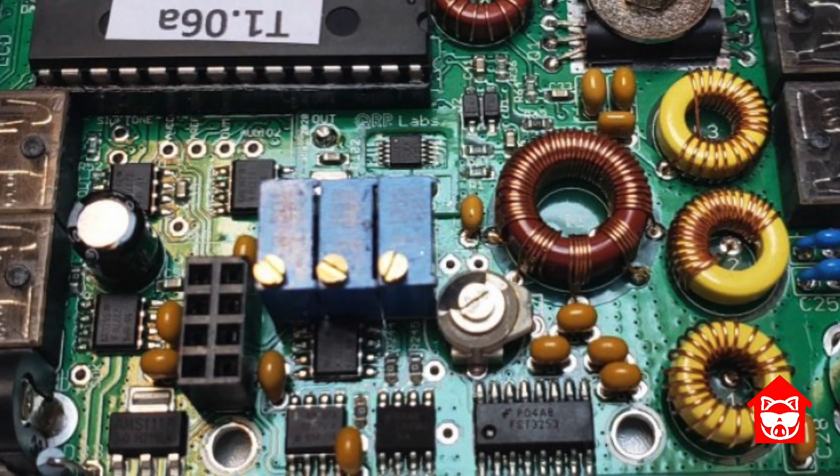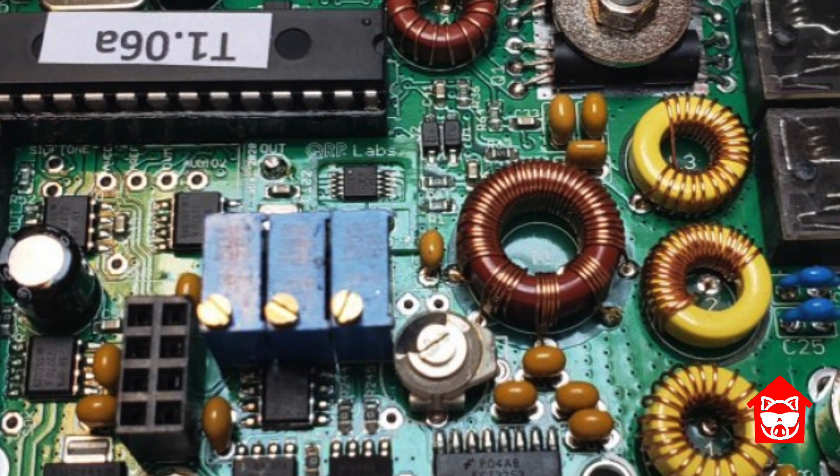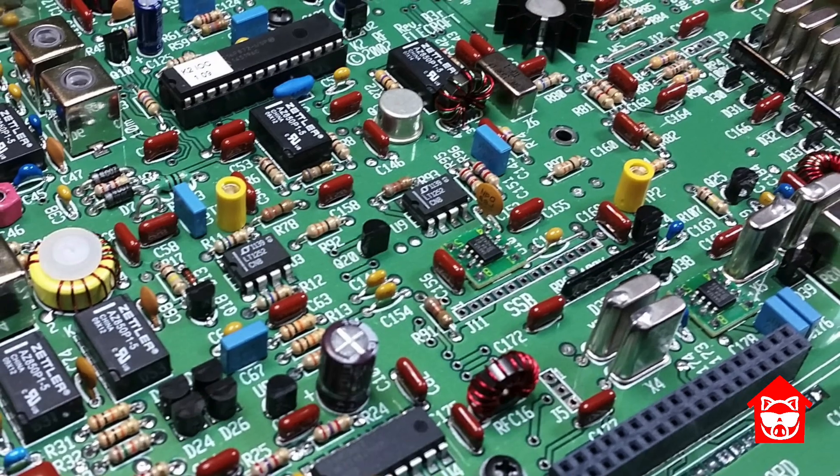The Mini has a lot of surface mount components which are already soldered to the board for you, which only leaves about 20 capacitors, 5 potentiometers, and a handful of other parts to solder. Compared to the Elecraft K2 that I built, it's not a lot of soldering. Certainly not the most challenging kit I've ever built, but I might think twice about it being your very first kit. I might start with a Pixie or Rockmite first. This would be a great follow-on, or if you're comfortable with soldering parts to a PC board, go ahead with the QCX Mini. The directions for the build are as good as it gets and very easy to follow. Hans has done a great job not only writing a great guide, but keeping it current as revisions are made. The built-in test and alignment equipment means you can do the complete setup without a shop full of electronic test equipment, and I was very pleasantly surprised that I got this thing working properly on the first try.